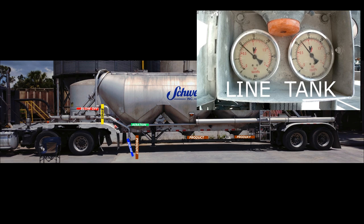Talked about this earlier. If not working properly, letting air pressure out at same rate as pumping in, you will get a lot of back pressure build up in silo, and could turn a normal 2 hour pumping time into 4 plus hours. But when you notice it's taking forever to unload first pod, or it seems like it wants to constantly plug up, just close product valve. After a few seconds, air line should decrease PSI at a steady rate. If not, get with customer. Let them know what is going on and maybe they will check out the filtration system.